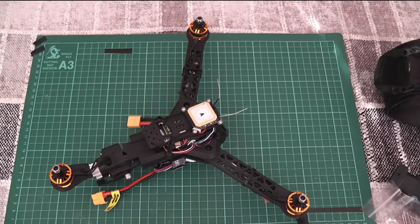I took it out to fly and do an auto tune. That wasn't very successful. It did vibrate in the air and it did wander away from me — I pulled it back, it started again, and then it stopped and looked like it had finished. I let it land, switched off the motors, and switched it out of auto tune mode. When I got home I found that the settings were exactly the same as I had set them before the auto tune flight. So nothing had happened.